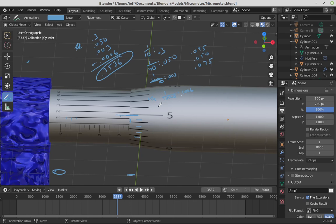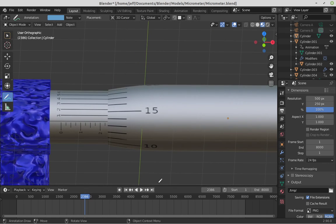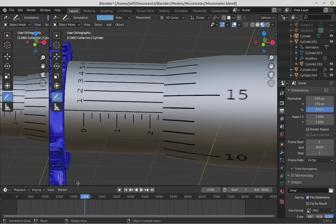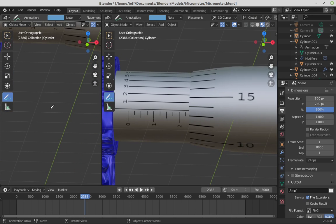All right, let's do another example. Let's come over here. Reading off the various scales, I'm going to give myself a little bit different space to write in so that I'm not constantly messing up where I'm writing by rotating. My first reading would be to the nearest 10th of an inch scale, and it looks like right here I'm past the 2, so this would be 2/10 of an inch, or 0.2.